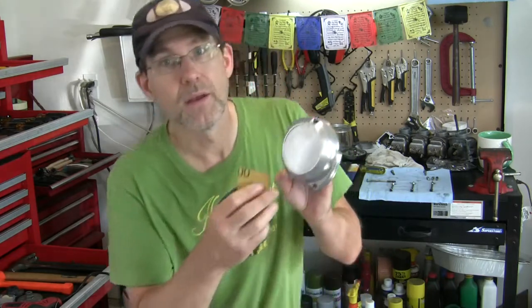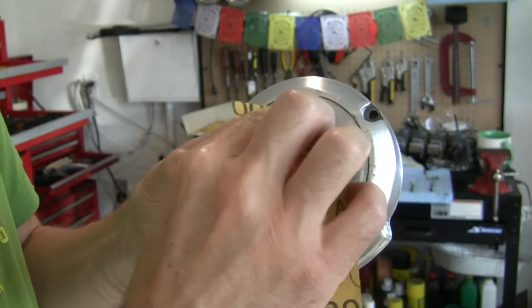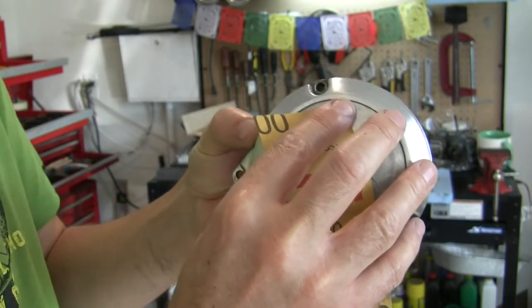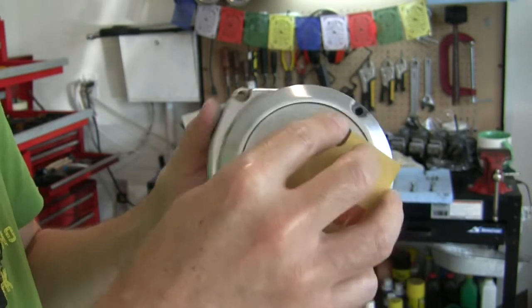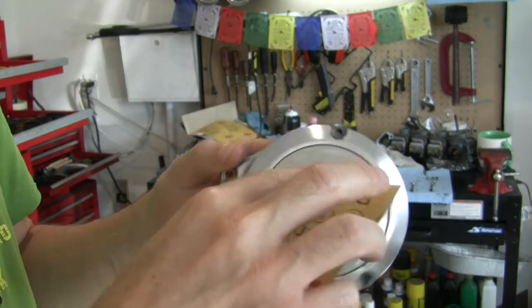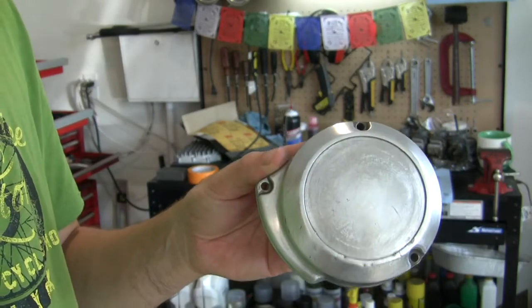Working around this edge — I've got this kind of lip here. What I'm doing is starting with a really good fresh corner and working like this as I rotate the part this way until I've gone 360 degrees. Then I get a fresh corner, rotate the opposite way, go 360 degrees the other way, switch corners, switch my rotation 360 degrees, and then finally the last corner. So I do four corners in two different directions all the way around.